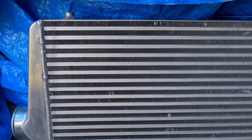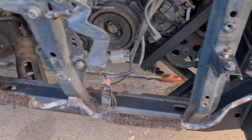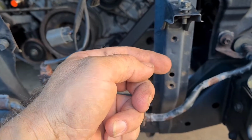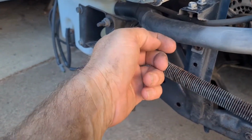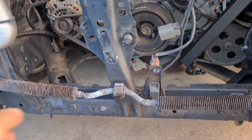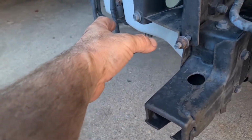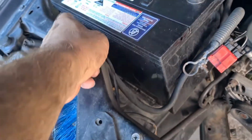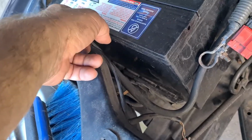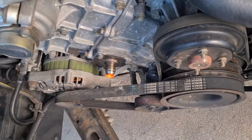This intercooler here, I wanted to mount it today, however I don't have a bracket that I can use, or anything that I can make a bracket from. So what I'll do, I'll be making a bracket to come down here, down there, probably around 50mm. It'll have to be a bigger bracket because the hole centers of the intercooler are less than those hole centers there. It'll sit there, piping will go up through there. That's going to go in the boot, and then it will come, depending on room, either straight up and along the top here and in, or from the bottom. It just depends how I go.